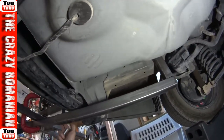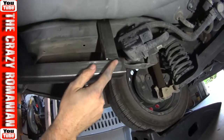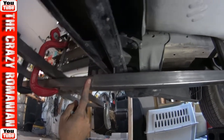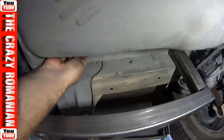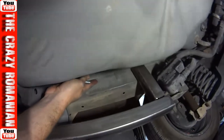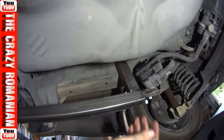For those wondering what's going on under the car: I have a piece that is going to slide in as the extra third support on each side. There are special bolts on the chassis which I found bolts that fit in — they were not occupied by anything. So I'm going to add one over here, one over here, and maybe a third one as support. This will be reinforced by itself and will handle 100 pounds easy, if not 200.